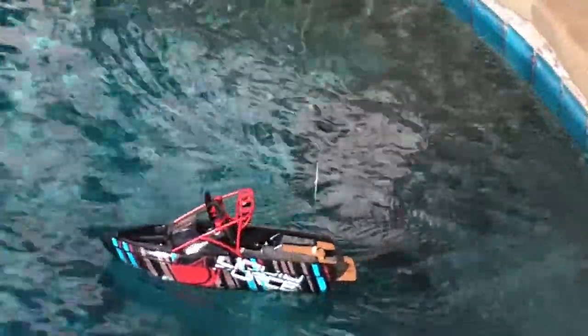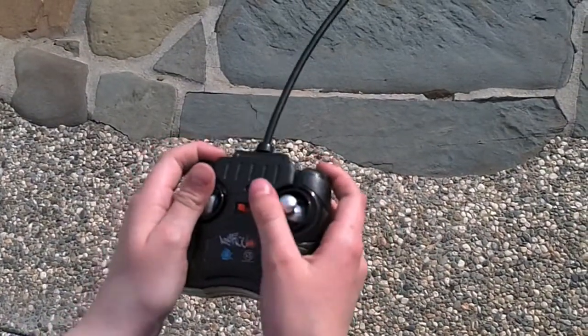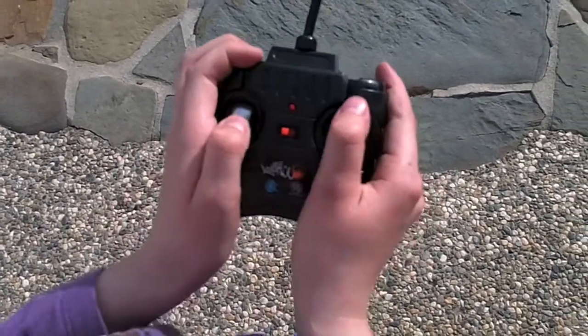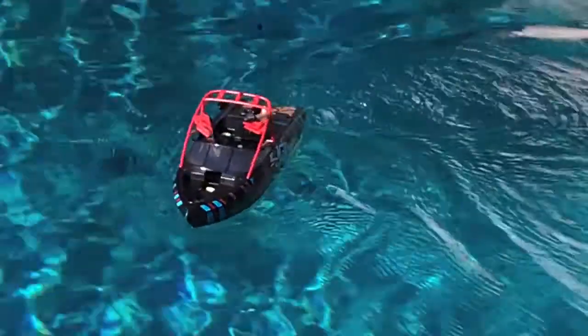This isn't your usual adapted toy. It's the RC Wakeboarding boat from Ronan Syndicate. Today, we're going to adapt it by adding four switch ports to the remote. Then we can play with it with four traditional switches or a switchimajig controller.